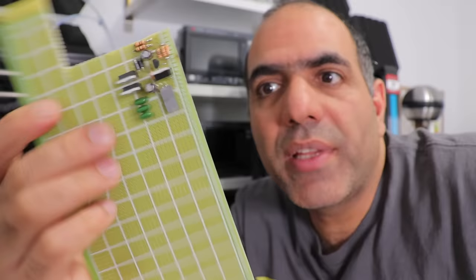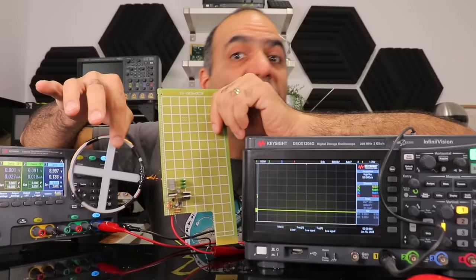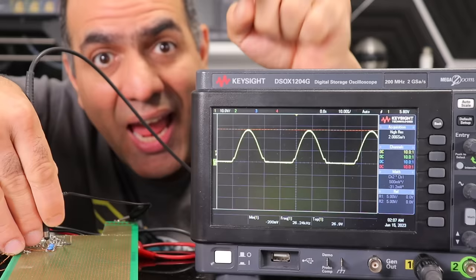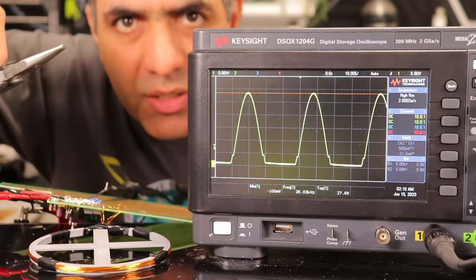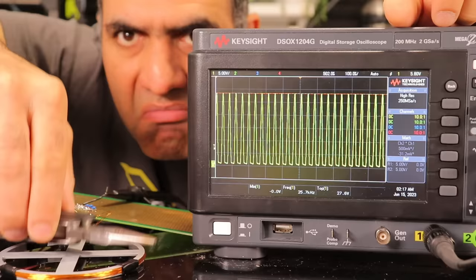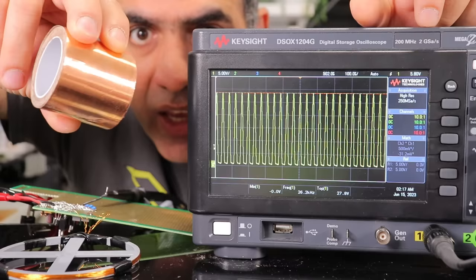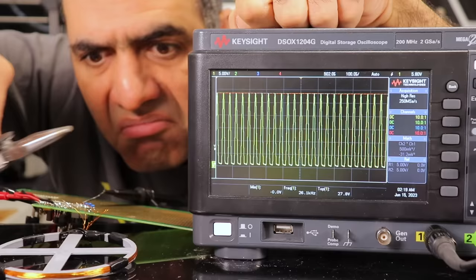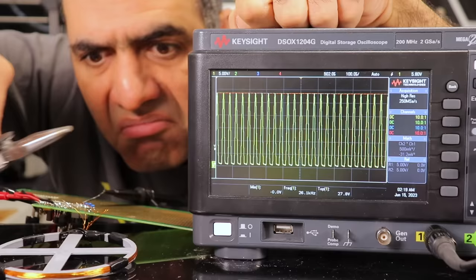I'll probably have to readjust some components like the capacitors to hit the right frequency. Here's the circuit running on 9 volts, so later I can run it on six AA batteries. This is the voltage across the coil at around 28 volt amplitude — a bit of a distorted sine wave because I think I miscounted some of my turns, but that's okay. I set the frequency to around 25 kilohertz. If we bring a piece of iron close, we see the frequency drops as iron increases the inductance. And if we use a roll of copper, we see the frequency rises as copper reduces inductance. But the frequency changes very little — maybe around one to two percent. How do we detect such a small change?